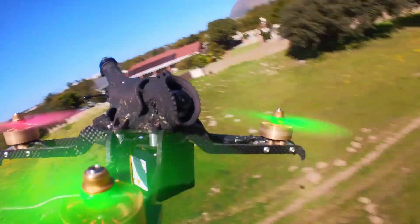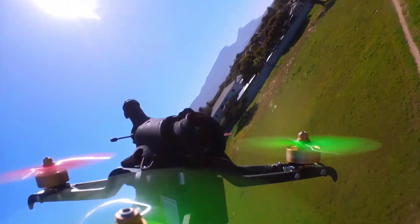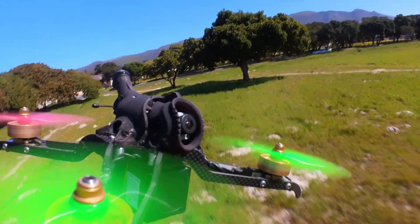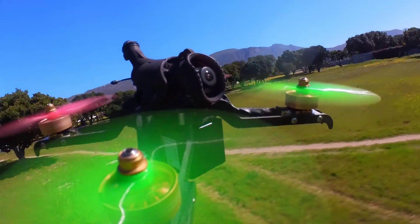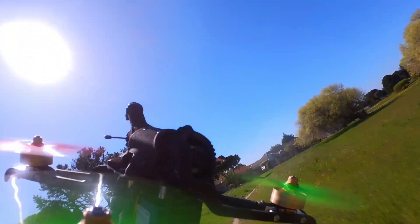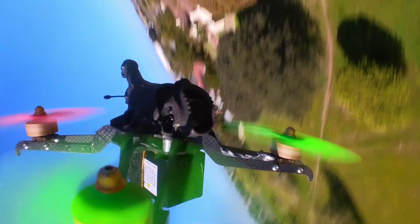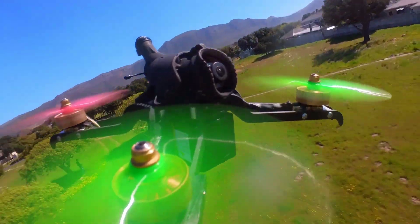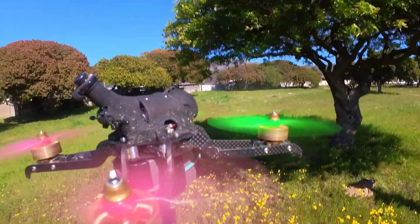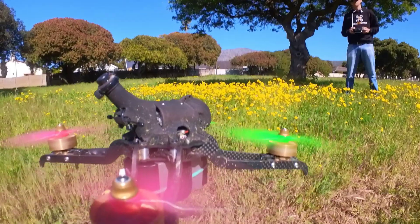When I fly these things, I feel like Han Solo, but when I look at them, not so great. I figured I'm going to build my own drone and make it look awesome. I'm well aware there's a pretty obvious reason that almost all drones look the same — the performance to cost and performance to manufacturing ease is really, really good. When you just cut flat plates of carbon fiber and bolt them together, you can use generic components, make your frame easy to use with multiple different components, make it cheap to manufacture — it's strong, it's great, but it doesn't look great.